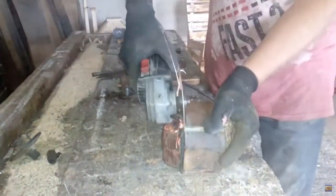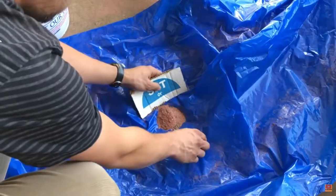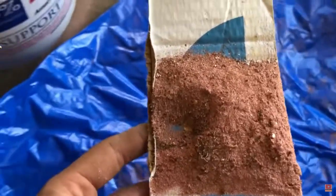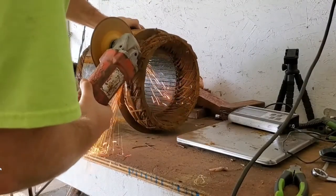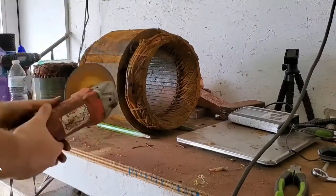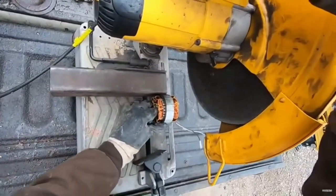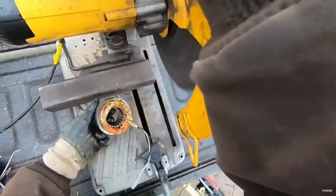The best tool, in my opinion, in terms of speed, clean cut and efficiency, is an angle grinder. The disadvantages are it removes a certain amount of copper, which ends up as dust mixed up with residues of abrasive, and each grinding wheel has a cost. But if you have many motors and you need to do it fast, this is your best take. However, you must select a wheel size that doesn't put you in danger — either cutting your hand off or flying into your face.